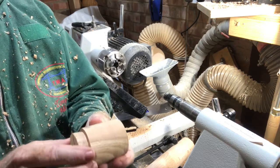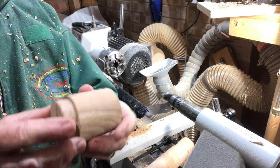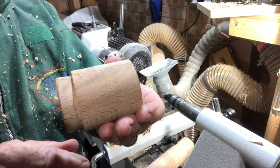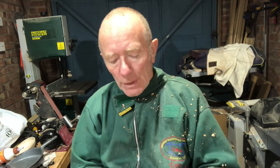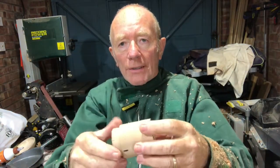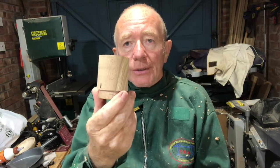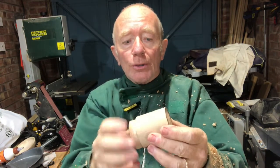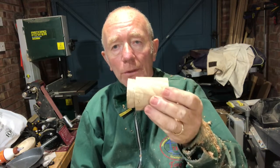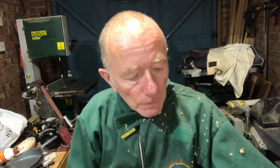What we're going to do now, for the next video, we will use that as a chucking point on a blank. Well, I hope you got a little bit out of that. It just gives you a little bit of insight into using a spindle roughing gouge. I also use the parting tool and making a dovetail for a chucking point. On my next video, I will show you how to use that as a chucking point to put onto a blank, and it saves putting the worm screw into it. I find that the best way, so that's something for the next video.